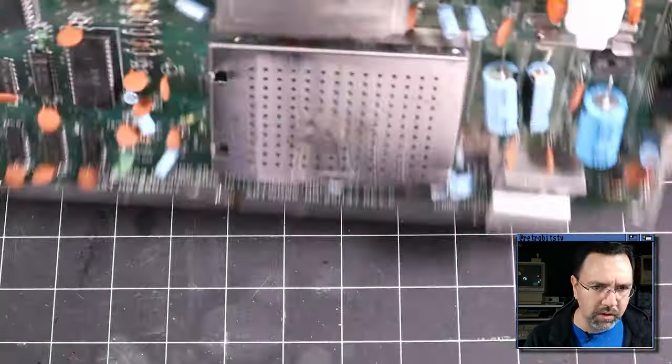Okay, what we've got is a high. If you can see here on the scope, we've got 2 volts per division. So it looks like that line is being pulled high, which is good. We want to see that. It doesn't look like it's 5 volts, but being pulled high is the normal unselected state. These things get selected when they're pulled low. So let's look at the next one. Okay, same thing. And the last one.